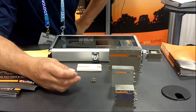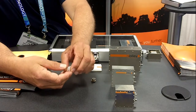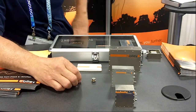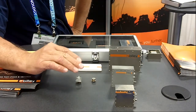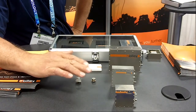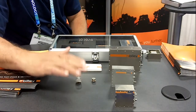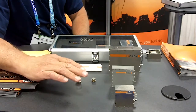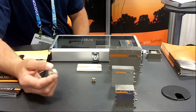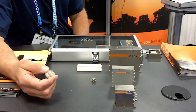In addition to the cut of the quartz, we can use various holders, such as this three-point mount. Typical OCXOs in the past used a two-point mount, which meant that the crystal was more in a cantilever mode, much like a diving board. As it went through motion, the unit would vibrate horizontally or in the direction of the axis, which caused a disruption of the frequency. When we go to the three-point mount, it's a little bit stiffer, and thus there is less susceptibility to vibration.